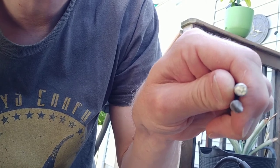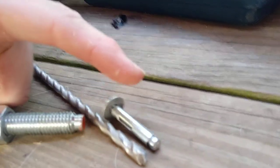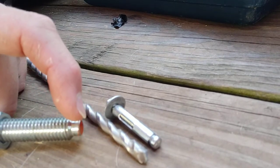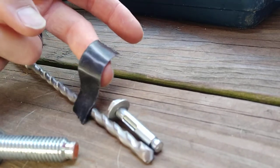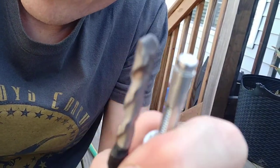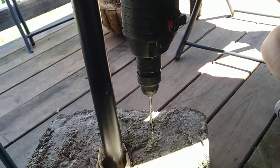Notice how this is a really long drill bit — it's really tough to figure out how deep to drill. What I like to do is go to the depth that you want and just wrap a piece of tape around the bit. I'll show you when it's done. So now we know we're only gonna drill to that depth — once we hit the tape, we've gone far enough.